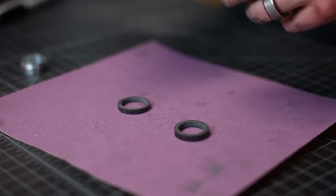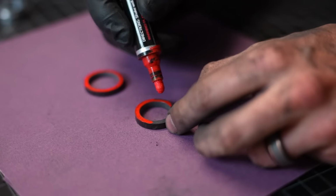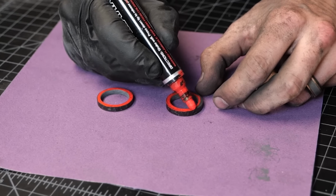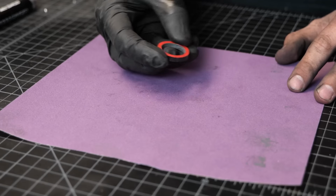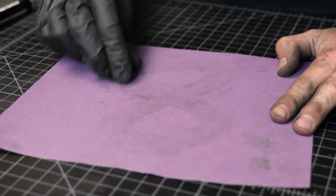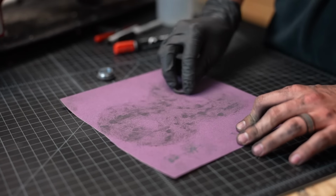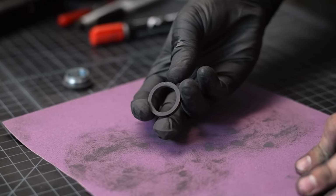All right, here's both of our carbon fiber accents. Before we join them together with the Bugatti aluminum, I need to make sure these are perfectly flat. So I'll use a paint marker to coat the whole outer edge of the carbon, and then I'll hand sand them slowly and carefully until I just barely get rid of all of the paint. That'll make sure it's perfectly flat, and once all the pieces are clamped together, there won't be any gaps between the carbon and the aluminum.